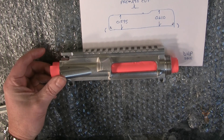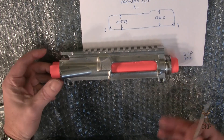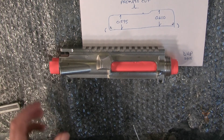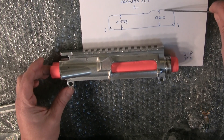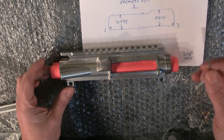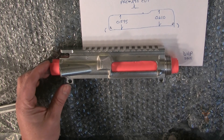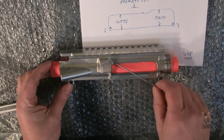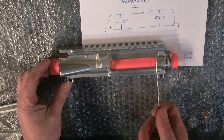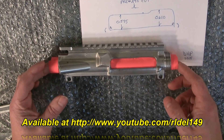I just didn't know what size I really needed to do it to. So what I did was use some rounds to see what would fit through the hole. I opened it up to 610 in this area, which is what it currently measures out to be. And 595 on this side where it's a little thicker and still modified. I could have ramped that down as well, but the shell is going to eject from this side, so I went ahead and gave it a try.